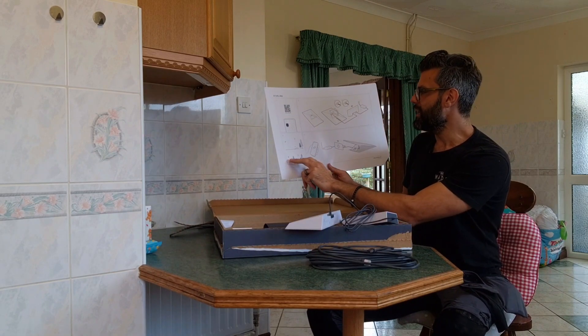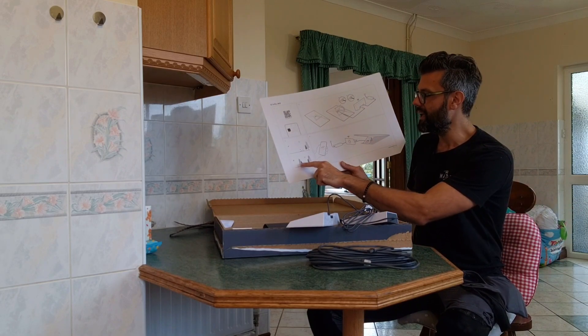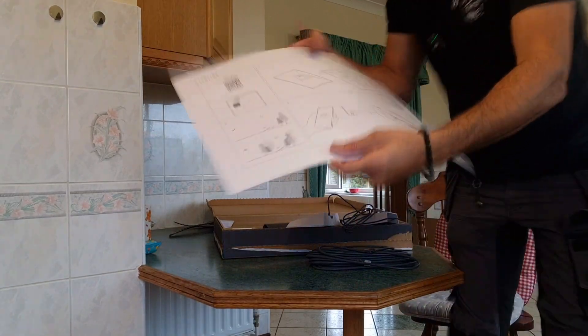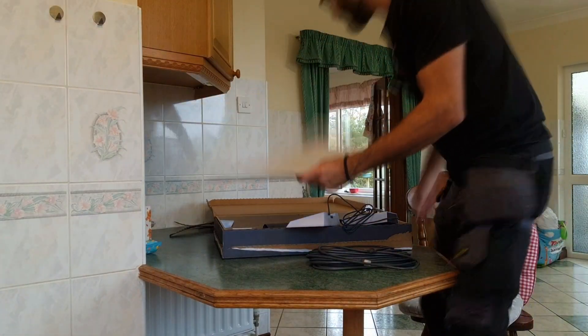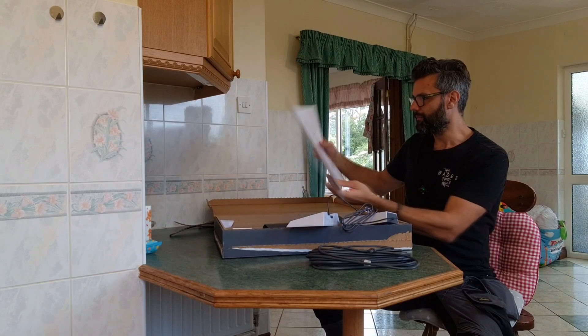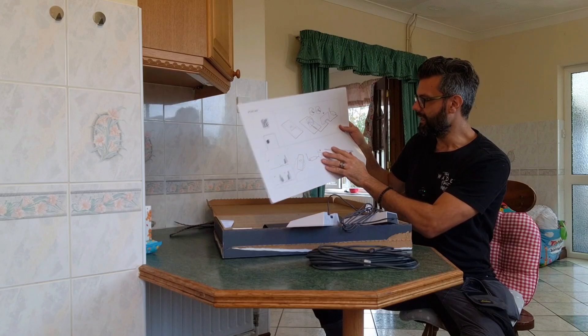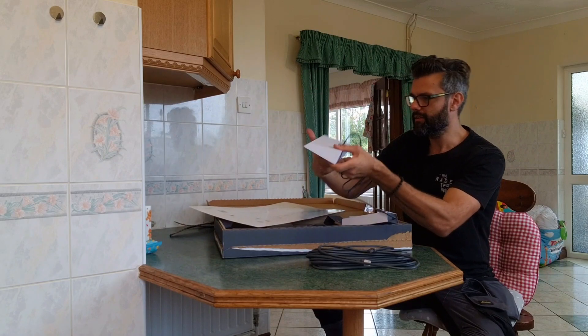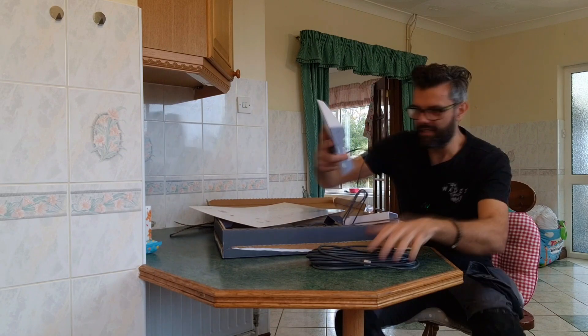Step three shows you 20 degrees of the bracket, so the bracket is set at 20 degrees to give you 110 degrees of sky view. It's showing pictures of trees — if you've got any trees or obstructions in the way it's not going to work. You need a clear line of view to the satellite, much like Sky, which is set on 28.2 Astra. Number four looks like we use our mobile phone since we've already downloaded the app to configure the Wi-Fi.